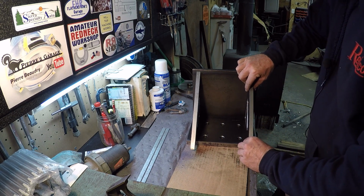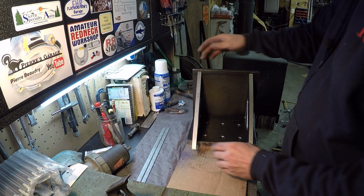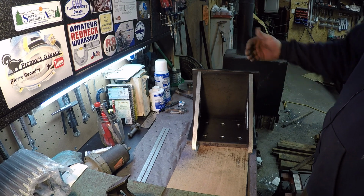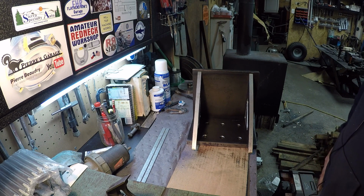I try to get it to where I can come in a little, but I know the farther in I go, the warpage up here on the plate's going to get really bad, because it's really going to pull, and it'll pull that in quite a bit. It'll pull this in, and that'll dip, and I'm going to MIG wire it, and I don't know.